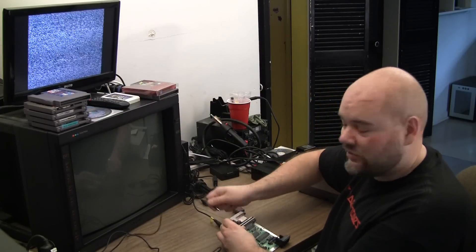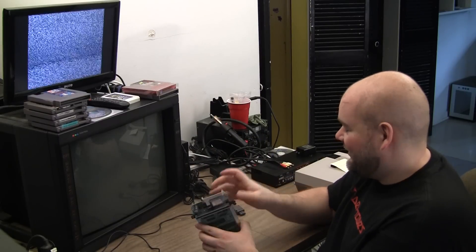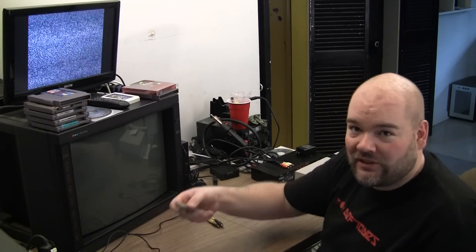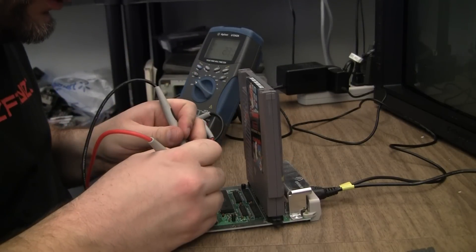So I have to look somewhere else, and I'm not quite sure where it's going to lead me just yet. It's got to be something on the power circuit, but usually other than the power cap and rectifier there isn't much else. But let's take a closer look — I'd definitely like to start out with simple stuff like voltage.